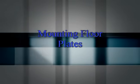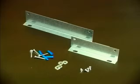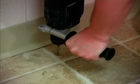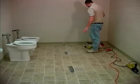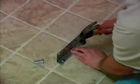Mounting floor plates. Using locations marked on the floor, drill 1/4 inch holes for anchors. Place the floor plate on the floor and fasten to the floor with number 12 by 2 inch screws, washers, and plastic anchors.